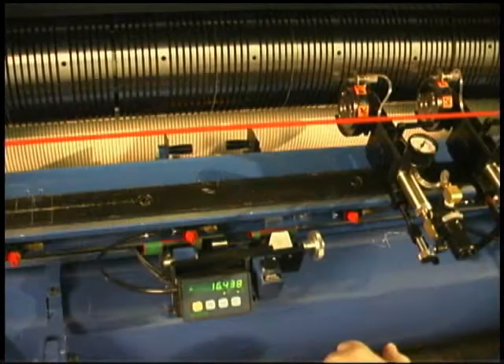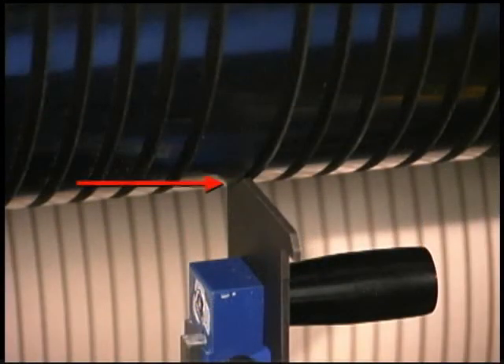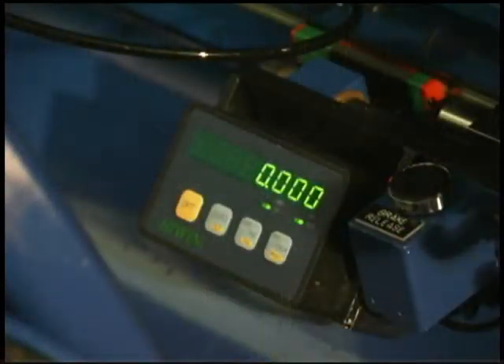This digital knife locator can help you set the female and male knives with the knife locator arm. The front edge is used to align the female knife, and the back edge is used to align the male knife. Please reference the Highwind Vendor Manual for additional information about the digital controls.